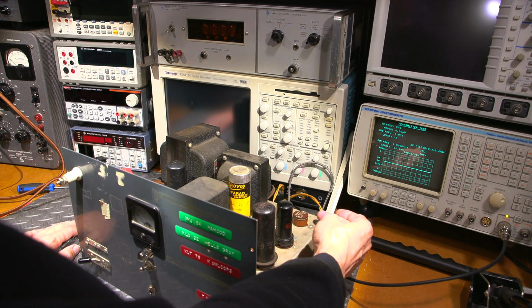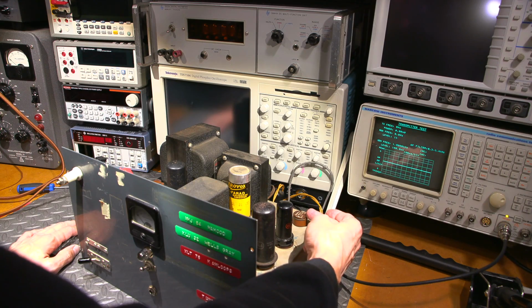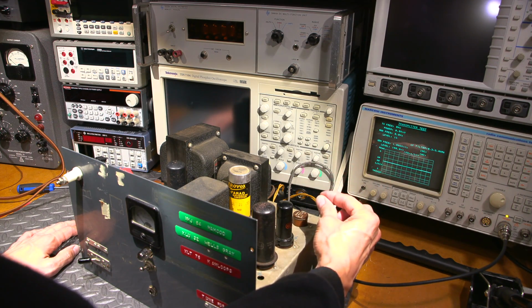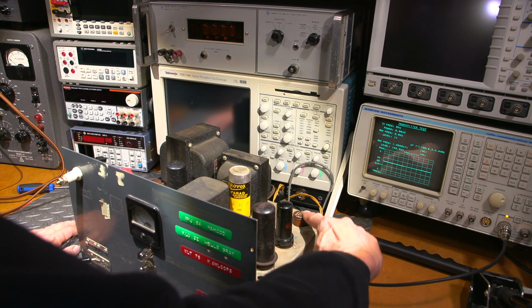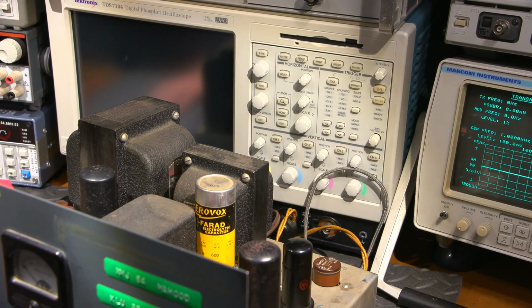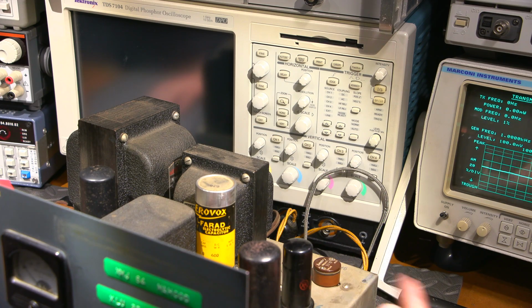So there's probably the connections inside the crystal are oxidized. So really what it is, there's a crystal between basically two metal tabs in there and they're just pressed together. And you can see there's screws on the top side of the rock here. So I'll zoom on into that. You see right there down in the bottom corner of the screen, there's some screws on the top, so you can take these things apart and clean them up from time to time.